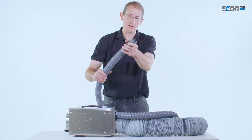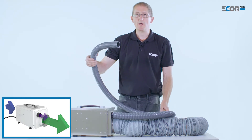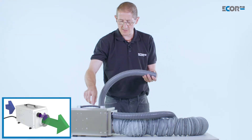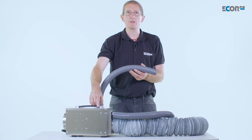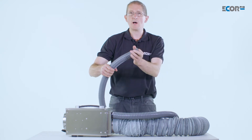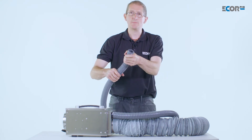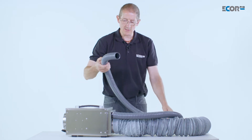In this case the humid air outlet is this smaller bore pipe here, and the length of this pipe is quite critical to the function of this machine. If this pipe is too long it puts a resistance in the machine and the machine can't cope very well. On top of that there's a high level of humidity that comes out of this pipe, and we need to understand what we're going to do with that — we really need to discharge that.